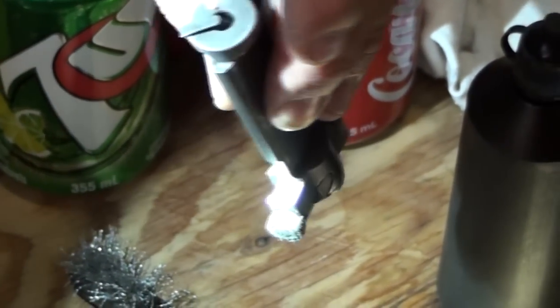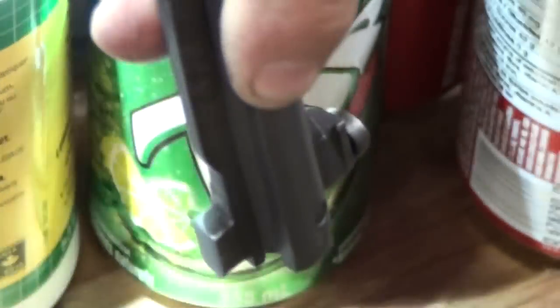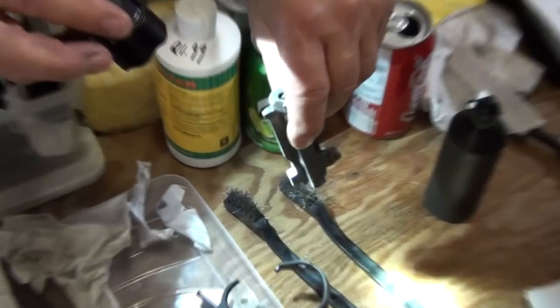Erratic — you see erratic, not very good lug bearing there. Has this gun even been shot much? Not that much. We tried to lap it last time, remember the bolt was very hard? Yeah, this one here isn't showing much for wear at all. But we can easily put the red on it and work it through.